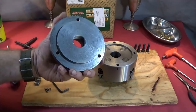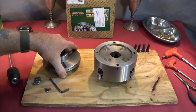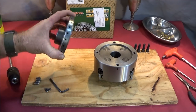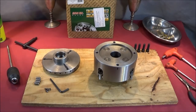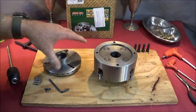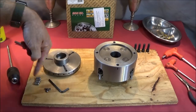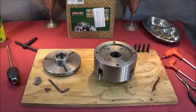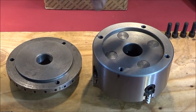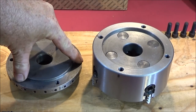If you buy one of these indexing plates you only need one — if you have the tool post drill and the pin assembly set up like I've shown in my other videos, you can use the one to drill all your other back plates as well. Any future back plates you need, you can buy the lower cost plain ones and just use your indexing one to machine those up. So now I'm going to show you a very simple tool that you can make up to transfer the positions of these four threaded holes onto the new back plate.